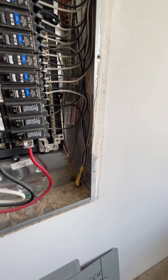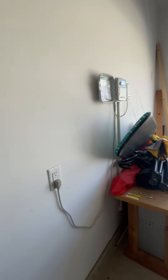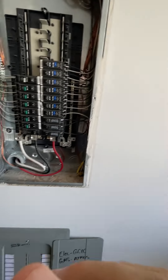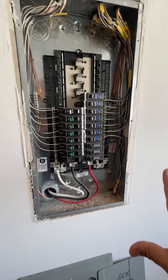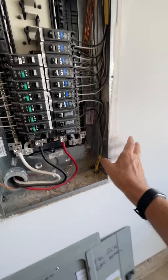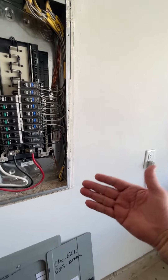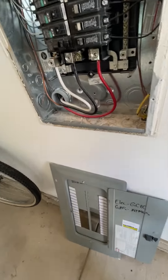This cabinet was screwed into place. I get it — screws are faster, screws are tighter — but screws do not have the same shear strength. If this garage were to experience a tornado, for example, this is going to pop out like a pimple. If it had been nailed into place, it might stay. If it falls with the wall, you don't have a separate sparky box floating around for first responders to step over.